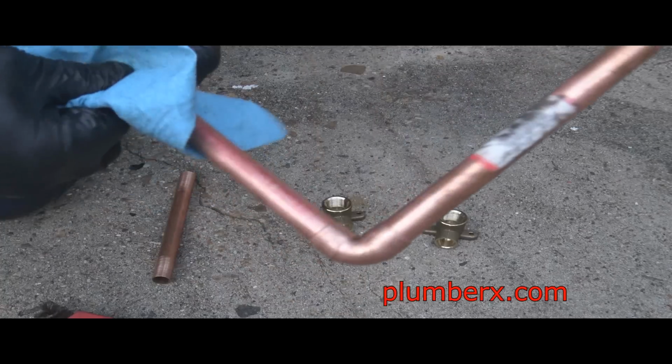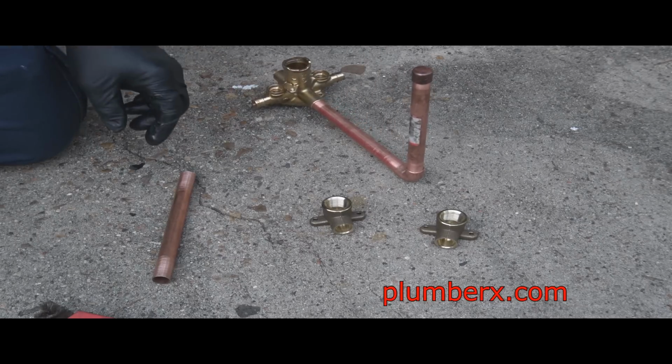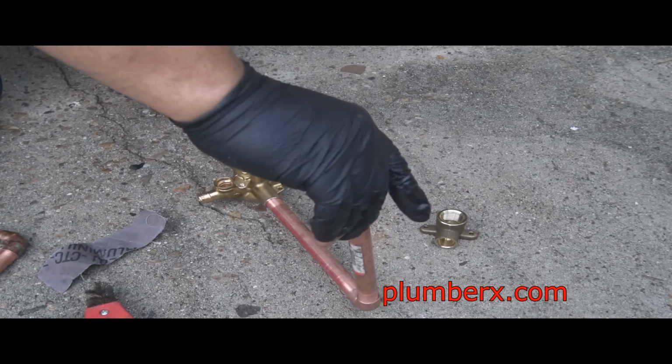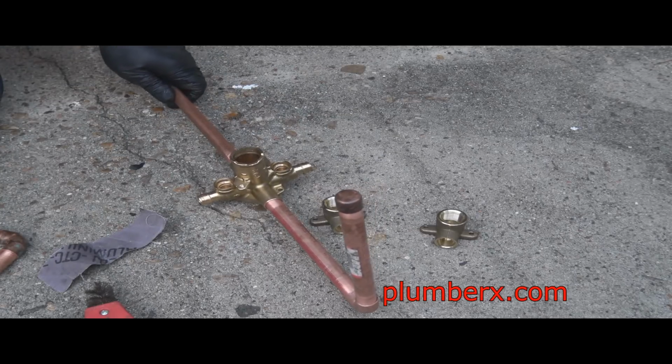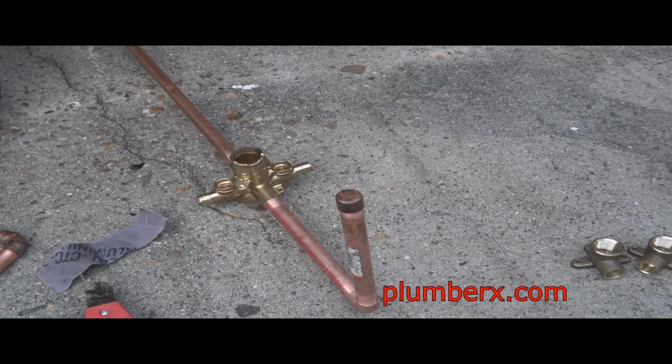And back to the galvanized pipe and the copper that we'll be using, we're only using those in strategic areas where we need stability. PEX pipe is great, but it's not a pipe that you want to use when stubbing out where valves and stuff like that need to be turned on and off, because you don't want the whole pipe moving. You want it stable. So that's where the hard rigid pipe like this comes into play.